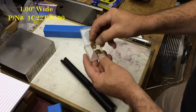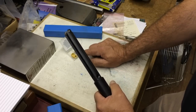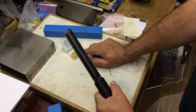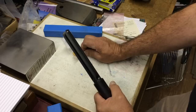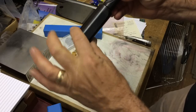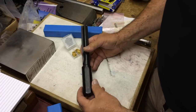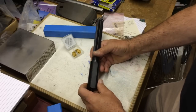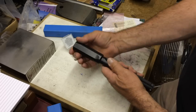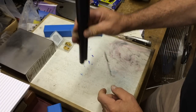These are TiN-coated inserts. You can get different geometries, different coatings, and different grades of carbide — C5, C2, and a couple others — even a cast iron grade. This has an inch-and-a-quarter straight shank with a flat on it. I don't have an inch-and-a-quarter end mill holder for the mill, which would work really nicely to use it there.